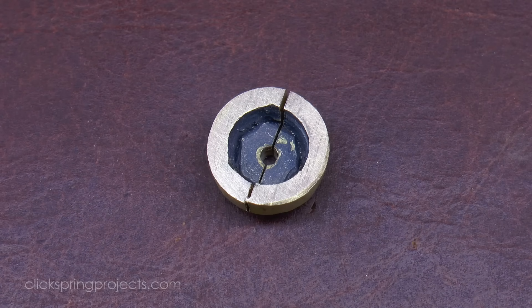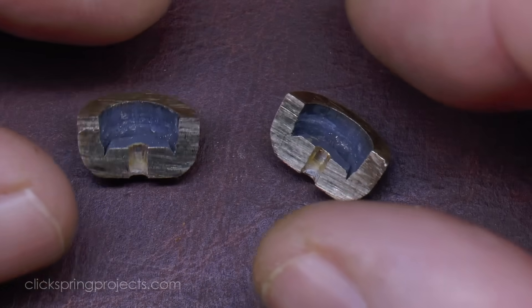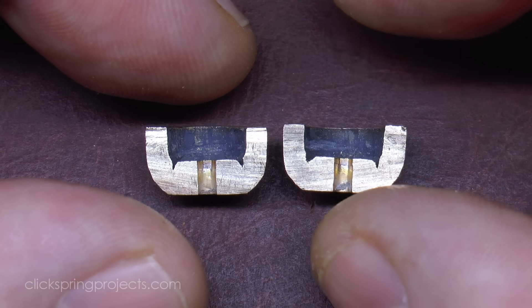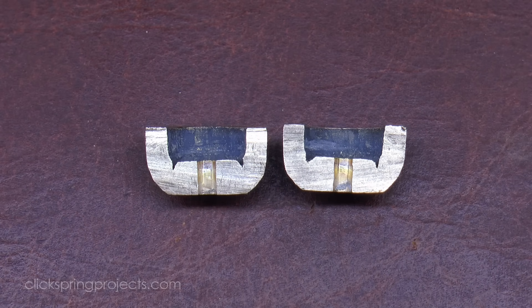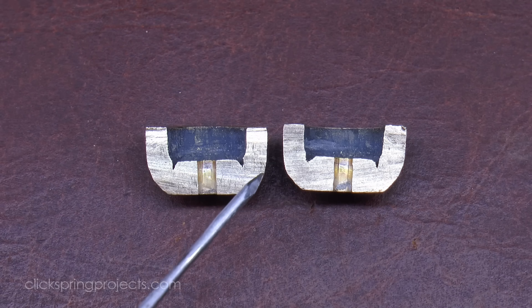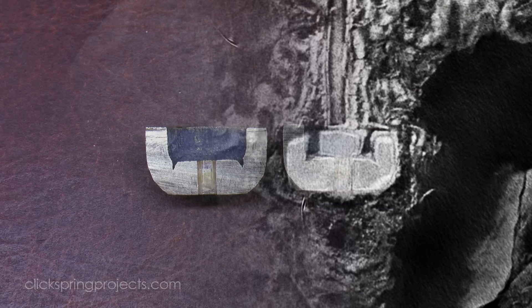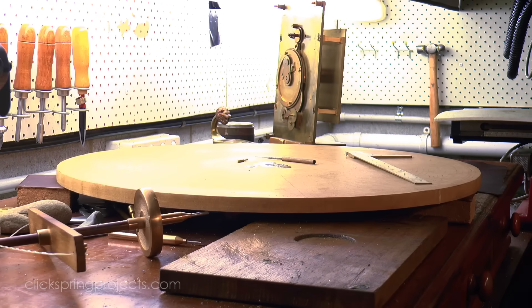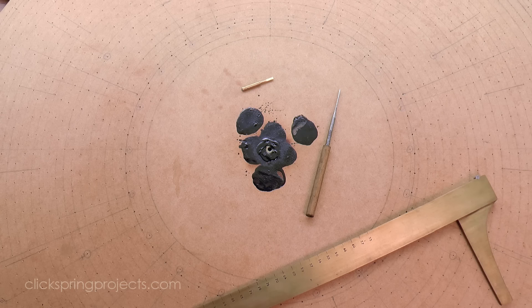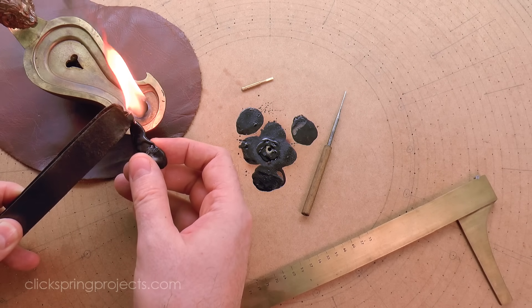I've prepared a second blank so that it can be split apart for a cross-check against the CT scans of the mechanism. The main details that I'm interested in seeing replicated are those associated with the forging and swaging process mentioned earlier, both of which do indeed resemble the scans. From here the part follows the process used to form the teeth of the other gears of the mechanism, beginning with division. Be sure to check out the video that describes this tool and the process in detail — I'll put a link below.